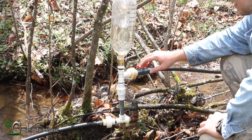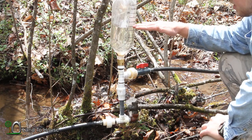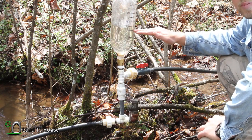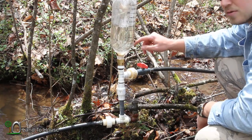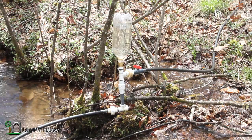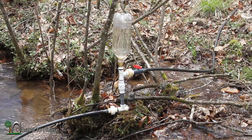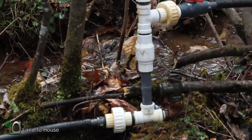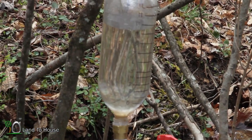The pump's been running for several minutes now, and I'm still not seeing any air with the snifter valve, which means the pressure has equalized pretty close to what's going up the delivery pipe. I just want to close the delivery pipe here and see if we do start getting those air bubbles. Well, there are a few bubbles coming up, but I can't seem to make it gulp air like it was before on our previous test. I'm going to go ahead and replace that pipe with a snifter valve down there and see if there's much of a change in efficiency.